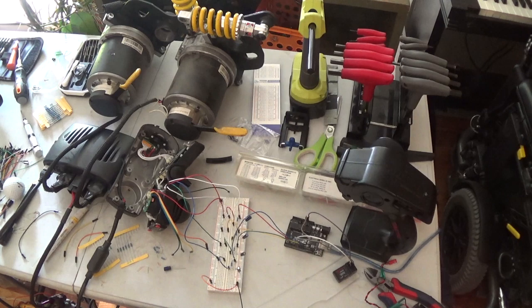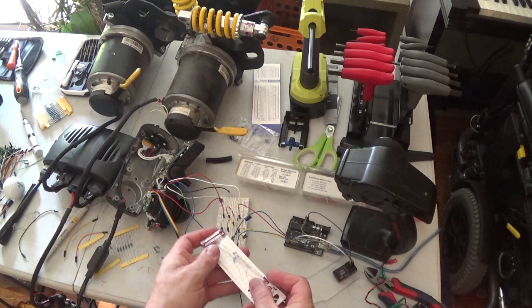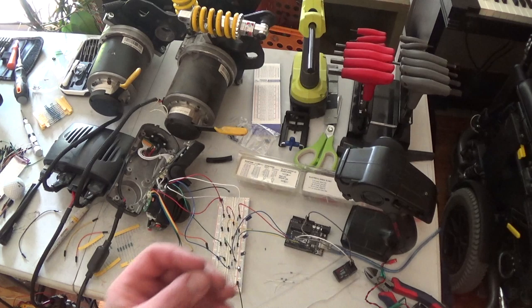Now, when I was first looking at this schematic, it wasn't making a whole lot of sense to me as to what was going on, because there was a bunch of resistors and capacitors that didn't have their grounds connected to anything. And I just assumed that the person left that off of the schematic, but as it turns out, connecting the grounds made it not work. And I just dropped one of these. Where did it go? These little 1/8 watt resistors are almost microscopic.